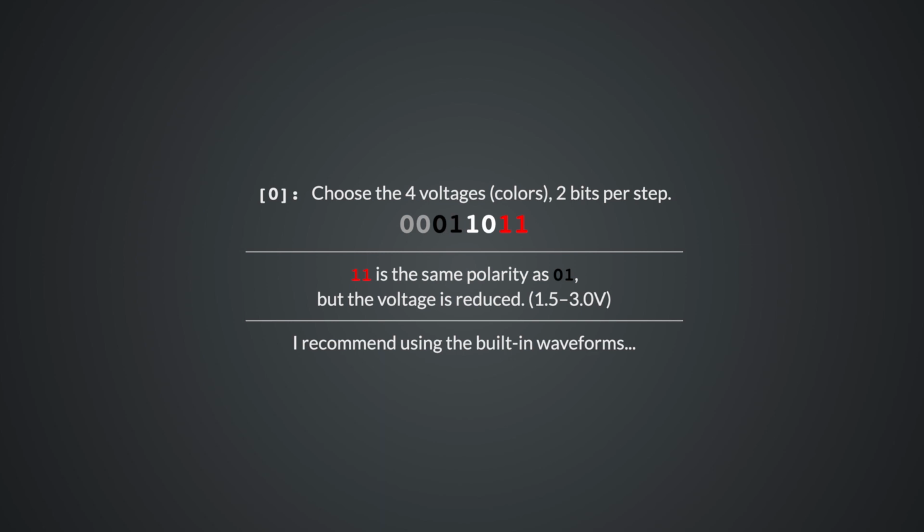The next image will probably look weird because now the particles are not in good places for doing another clean, fast update. This was a nightmare. This was horrible. So if you're working with the 3-color boards, this is one time where I would actually recommend just sticking with the built-in waveforms, because this will actually save you a lot of pain.